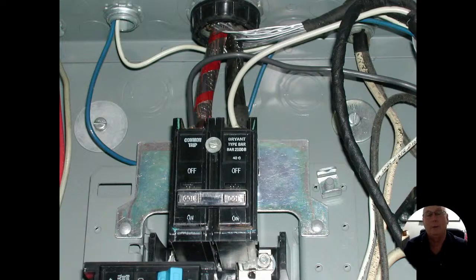This one here, I refer to this as top loading, all right? So we got a 100 amp breaker, and the red striped wire has a single 100 amp breaker. The black wire has a 100 amp breaker that comes in there. They're tied together, all right? So even though we have two wires and each one is on 100 amp breakers, again, we do not add these up. This is still a 100 amp service that comes in there.